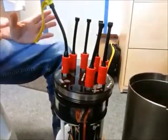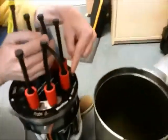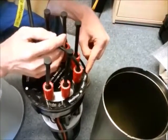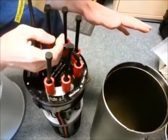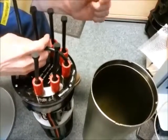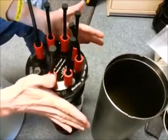Let's see what we have here. This one is used to charge the batteries, whereas this one here is used to program the timer. It's really important that the timer is programmed correctly so that it's in sync with the winch. The winch, which is moving the profiling instrument platform up and down, is going to be activated once per day, or in some other missions, twice per day. But it is really important that at the moment the winch is activated and starts moving the platform up, that's when you want all these other instruments to start reading and the logger to start logging.